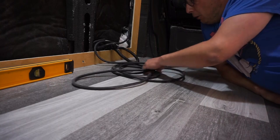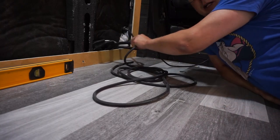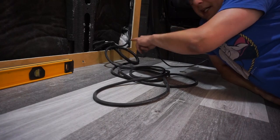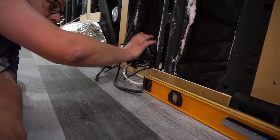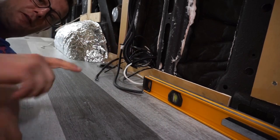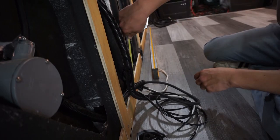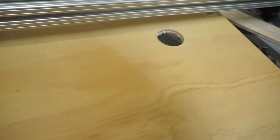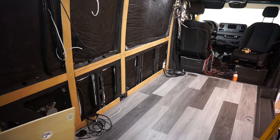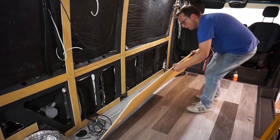Now that we have those measurements — length and width — we do have to keep in mind that we have wires that come through this wall. I need to make a hole here and a hole here, including a spot for one of those blue electrical boxes so we actually have a plug in this spot for our 115 volts. We'll take our rough measurements and copy that onto our board inside the garage and simply drill some holes, and we're ready to install. Oh yeah, I guess you're probably gonna need a hole saw as well — I don't do these tool lists for the most part being a first-time builder. I don't even know I need the tool until I need the tool.